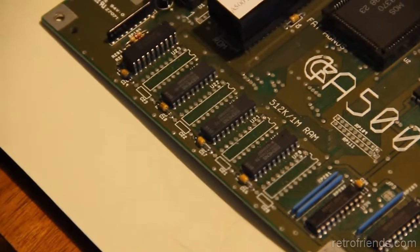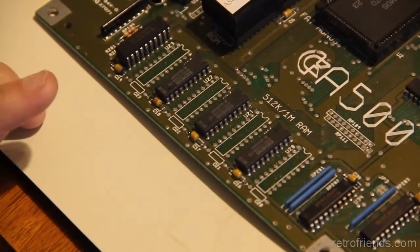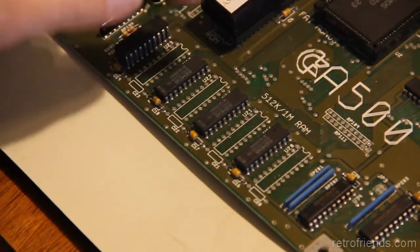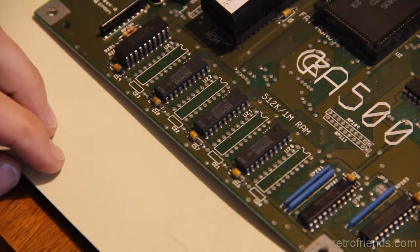Oh, two bad MEM chips. Pretty par for the course. It's usually two that are right next to each other, just like that. Most of the time, in my experience, two chips go bad and they're the two right next to each other, and they share a lot of addressing and stuff. So anyway, two bad chips.